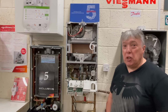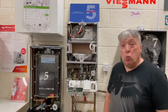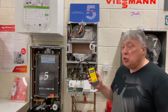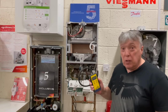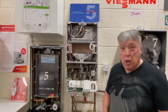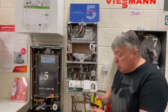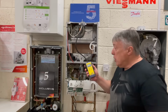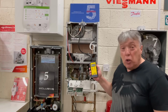One way we can measure the quality of the fan is using air pressure. Water gauges are a complete waste of time because they're simply not accurate. We need a digital handheld one, and there's also one on your gas flue analyzer. So first of all, what we need to do is to simply remove the tube that blows, which is identified either on the air pressure switch or on the fan. And then we put our manometer into the same hole, switch on, and this is going to be one of those very rare times that we switch the hot water on demand.